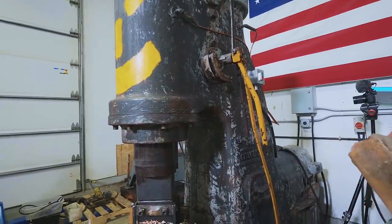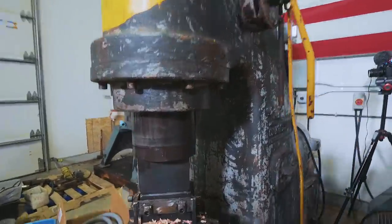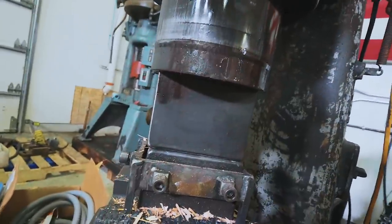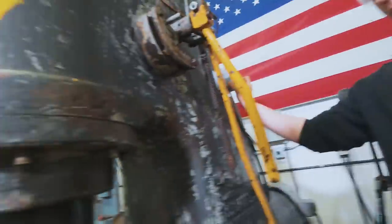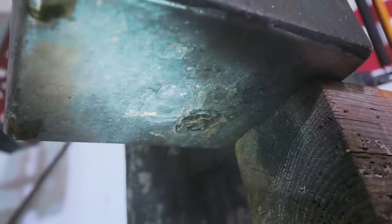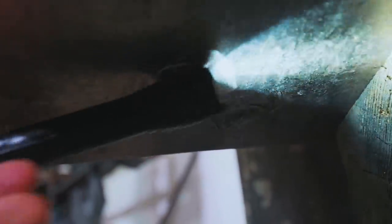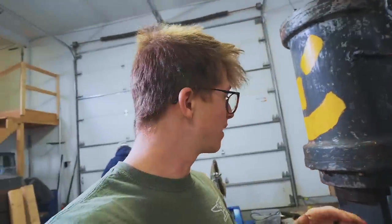Let's get back into the episode and hopefully get forging on some steel. To forge steel, we need to do a few more things. One of the things we notice when we turn this on is that top die — it is pretty chewed up. Have a look at that. That is not a happy camper of a die. It's chewed up in two bits. So what we're going to do is pull the die out of there and resurface it on the mill. We have this block of wood that's going to support the ram up just enough that we can get the die out of it.